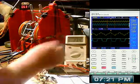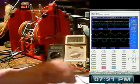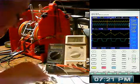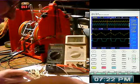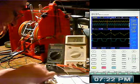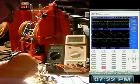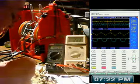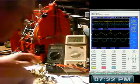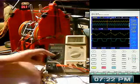Why don't it do a damn thing? Well, I always thought this could all come out, it doesn't do a damn thing. That was a wasted effort. I thought it did, but this trimmer doesn't do a damn thing either. Well, I'll leave the trimmer in, but I'm going to connect this lead. I'm basically just trying to offset the gate trigger point, really. So I've got this biasing coming in. That's going across to that resistor, which goes to the gate to trigger the gate.